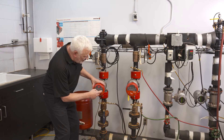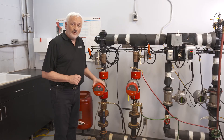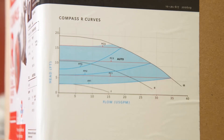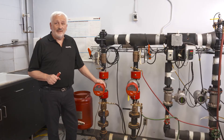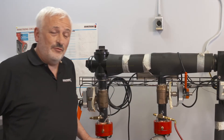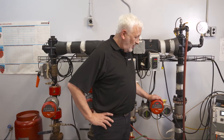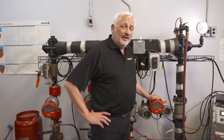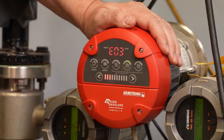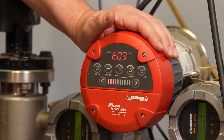You adjust up or down using the left or right buttons — those are the control modes for Compass R. Performance curves are included on the box for details on settings. Emptying the system of water and running the pump dry will generate an error 3 code on the Compass R readout. Page 10 of the installation and operation manual explains this issue and advises corrective actions. The Compass R controls will stop the pump to prevent seal failure.